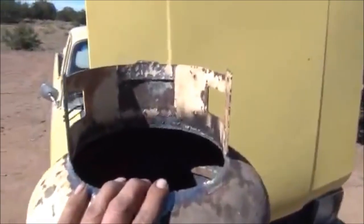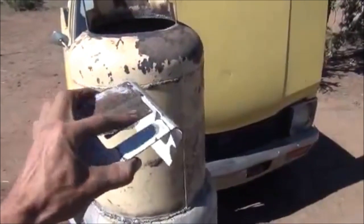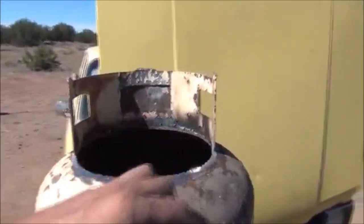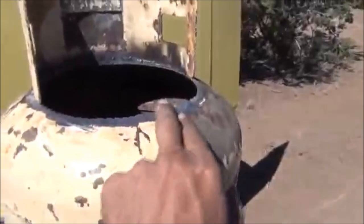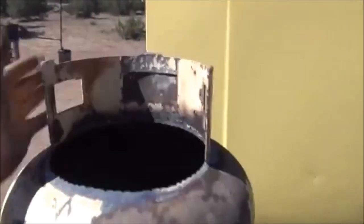What you see here is the handle from the top of a propane tank — looks just like this. I flattened out the loop though; these were folded up on themselves. I've cut a much bigger hole in here, and to get that hole diameter, I cut off the bottom ring that was already attached to the propane tank because whoever had originally welded it on had set it off-center so much that I couldn't use it. I've cut it off and that's about the same size as the hole, so we're reducing one more time — three stages of reduction here. I've now completed my weld on this side, walked it around, and now I'm going to form the other handle and put it on, then attach another plate around this and the other side of the bell on top.